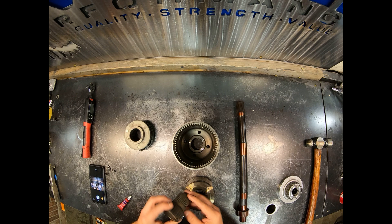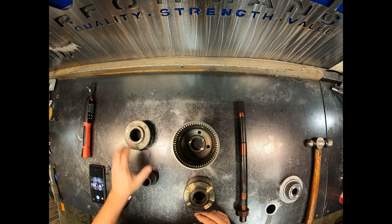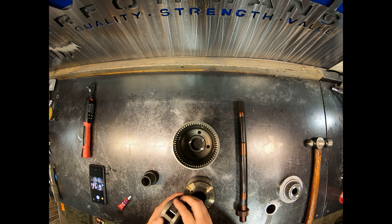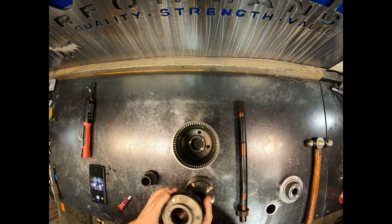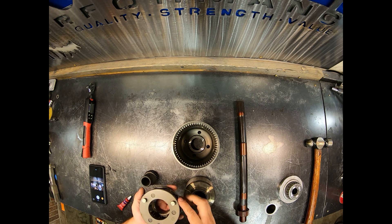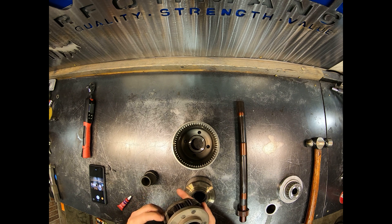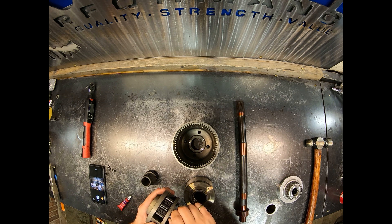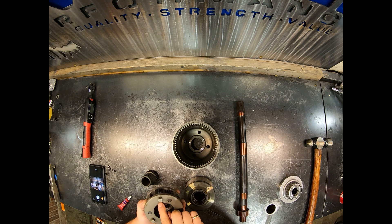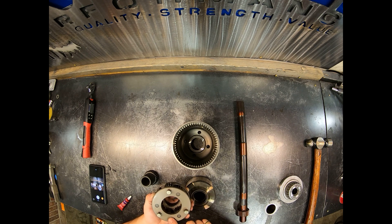The next component is the sun gear — that is this little piece here. Then we have the planetary carrier assembly and the planets. This is similar to an automatic transmission in the way these little gears work. You want to make sure these pins aren't backed out or loose. They will come out if you use a punch, but normally they should be pretty snug. If this hole is rounded out or damaged, then the carrier assembly needs to be replaced.